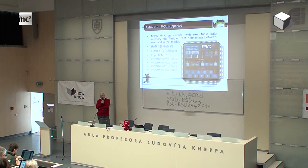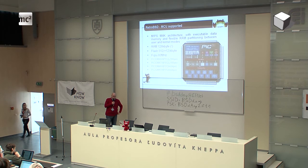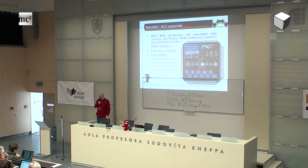You need at least 128 kilobytes of RAM — please be aware, I'm talking about kilobytes — 128 kilobytes of RAM to run this RetroBSD. Flash is basically empty. These chips run on an 80 megahertz clock, both CPU and memory side and peripheral bus, so they are extremely fast. But you cannot compare these chips with the chips in your mobile phones with Android — that's another story.